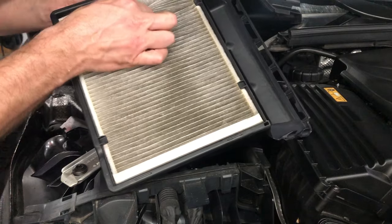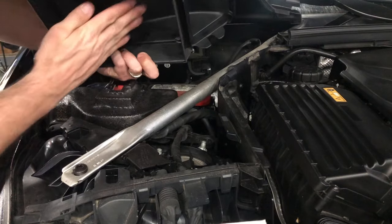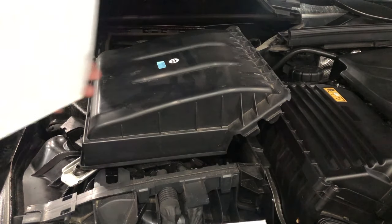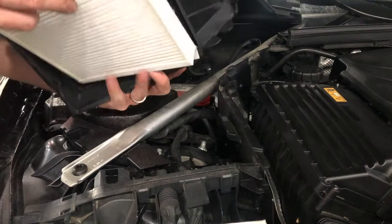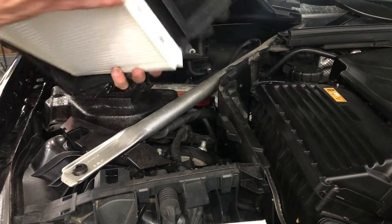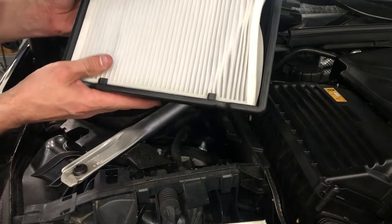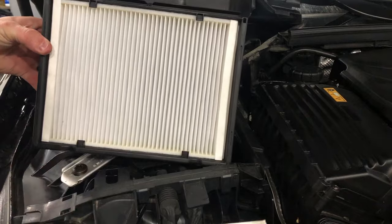This dust filter is literally just to keep contaminants out from going inside the cabin. Airflow is from the bottom up through. We'll put our new filter on here. This filter is part number CU25002. Airflow goes this way, so when we put on the filter you can see the airflow direction. Go ahead and put it back in the cover, wedge it down in here. It's fit into place just like that — piece of cake. Get rid of the old one — look at the difference.